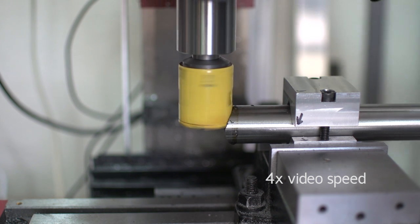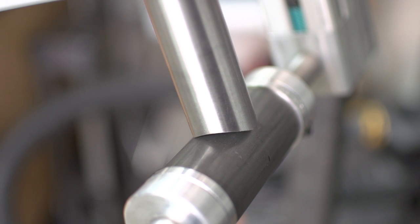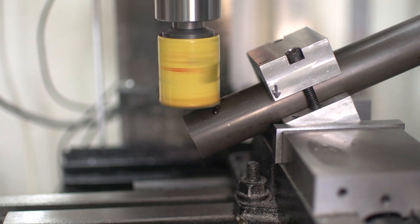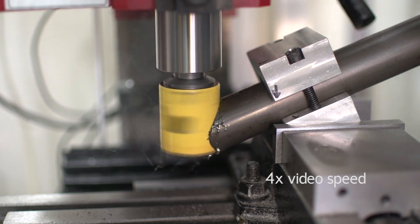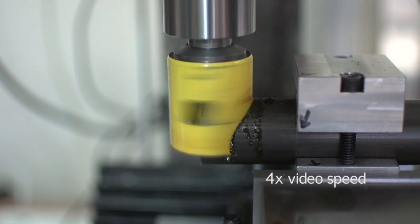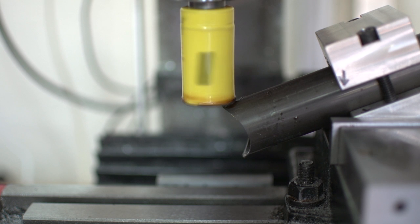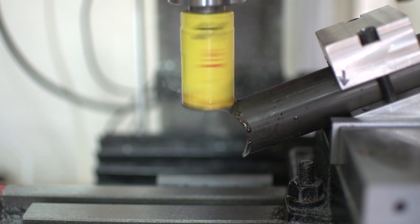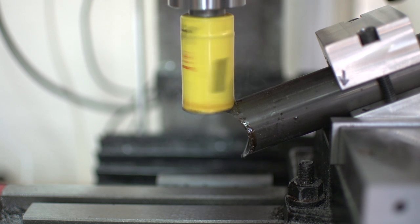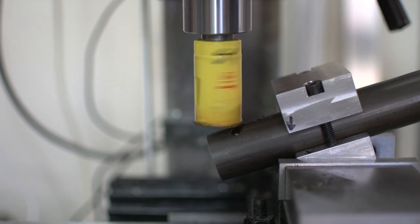Here's a look at the new fit-up. Now we'll do the down tube, starting off at the front where it meets the head tube, and now the end that meets the bottom bracket shell. Finishing it off with a notch for the seat tube. Something I started doing for the seat tube cut is undercutting it just a hair — I'll go back and forth a few times, test fitting it, and then shaving a hair more off each time. If you take off too much you cannot put it back. This is a pretty good way to ensure a tight fit-up. And finally, the top tube.